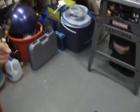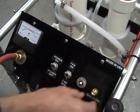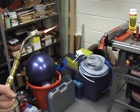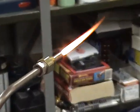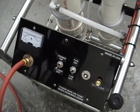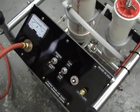We can use this gas control valve to control our flame. We like to keep it down around 7.5 amps, but we can crank it up as high as 10. And the warmer the cell gets, the more gas it produces. Right now it's running cold and it's putting out about 2.1 liters per minute. And this is our HHO torch. We'll shut it off. We turn off our power. We can leave the cooling fan on for a while if we want to. And that's our HHO torch.